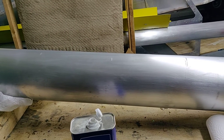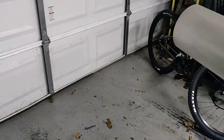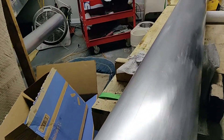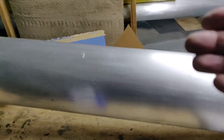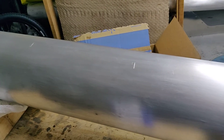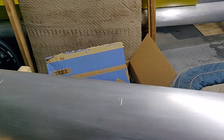These three right here really bother me. If I could measure them and they came out at 50 thousandths, I could dress them. For right now, I'm gonna see if I can mount up the wing and see where they actually lie. If this is the bolt index hole, then this would be the top proper and they're right on the top. Now I've read that some people have turned the spar so if they had defects it would keep them off. On a wing spar, this side will be in compression, this side will be in tension.